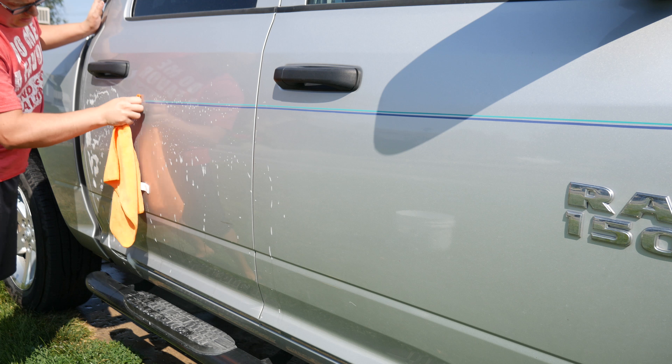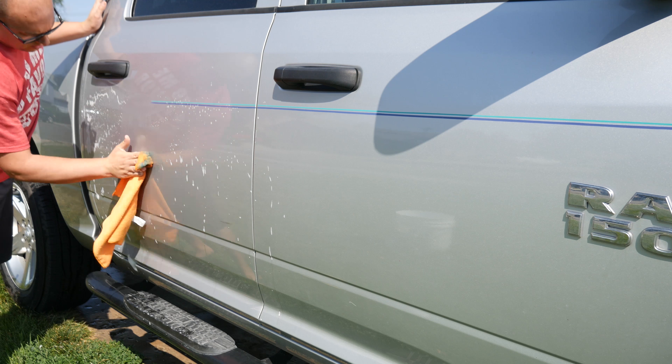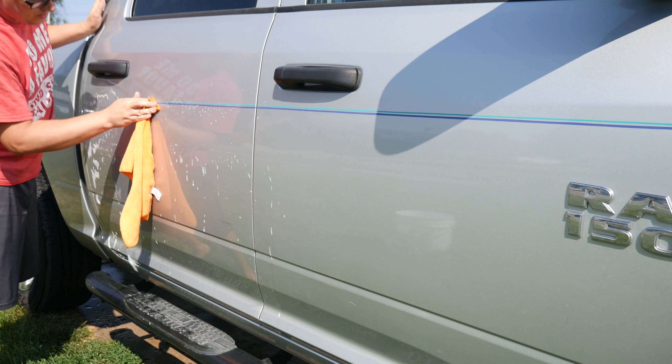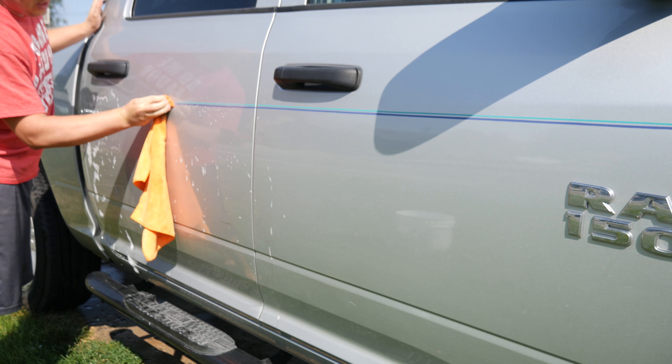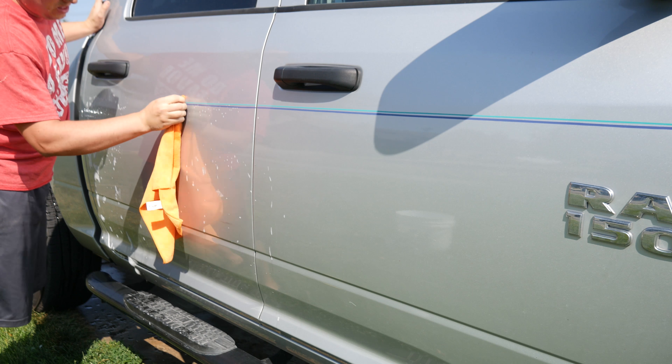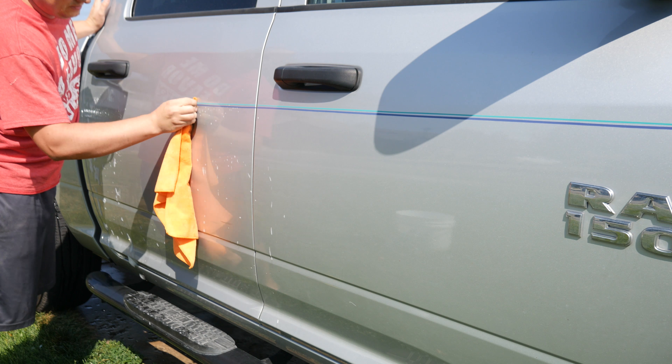So we're just going to work our way down. On occasion I'll soak the rag back up and just remove kind of that little residue of the paint that's there. Now if that does dry and you notice it after the fact, you can use maybe the rough side of a sponge to help pull that off, or you could just use a little bit more lacquer thinner and some water to remove it.